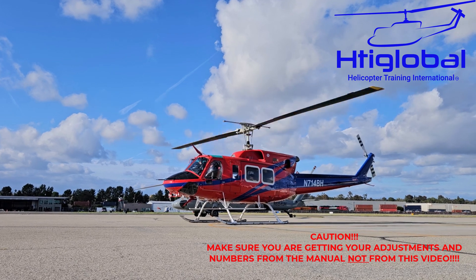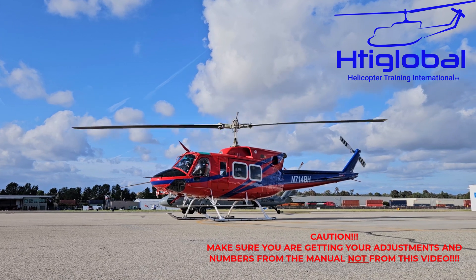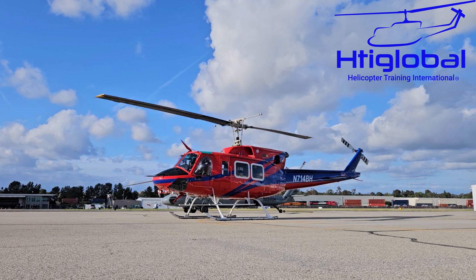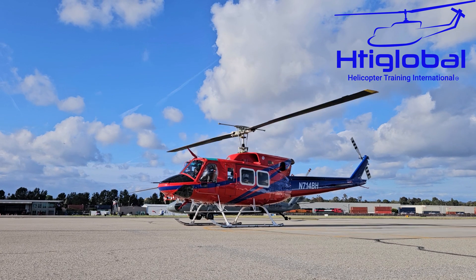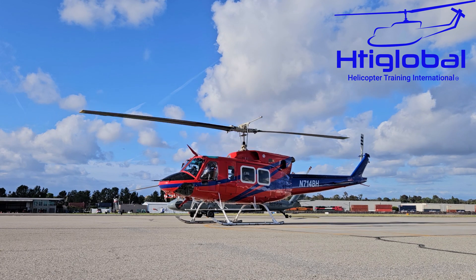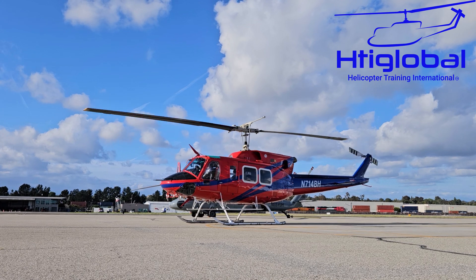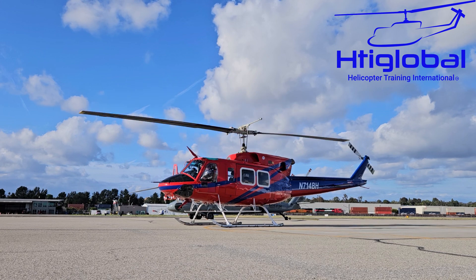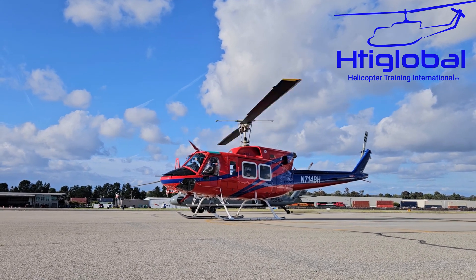Note 3: In very bad cold weather conditions it may not be possible to do the maximum N1 check before reaching the maximum torque limit. When you use the slave stop in such circumstances, refer to the airframe maintenance manual to do an in-flight maximum N1 check. Note 4: During adjustment of the gas generator maximum speed stop, ensure the following conditions: the internal threads of the index lever are fully engaged, and the stop screw touches the part power trim stop in the in-use position. Thank you for watching this video and please subscribe to our YouTube channel at HTI Global.